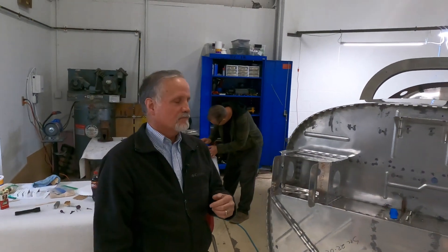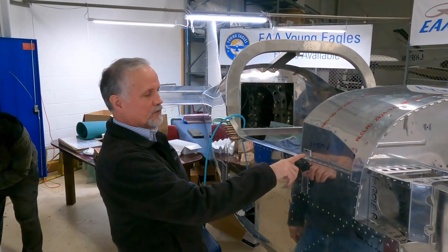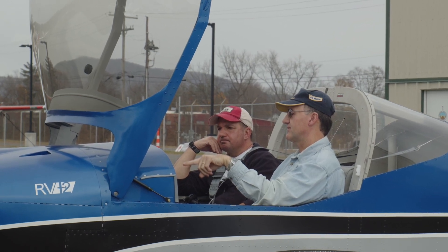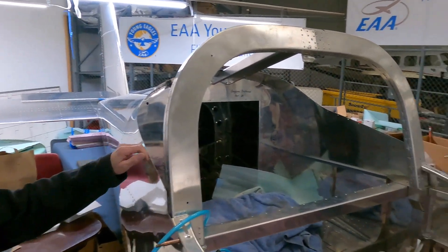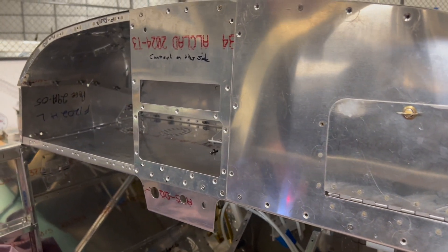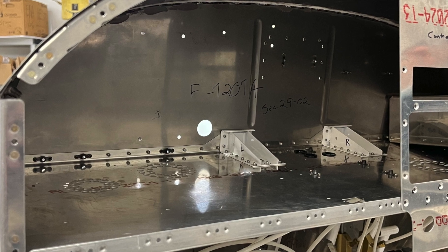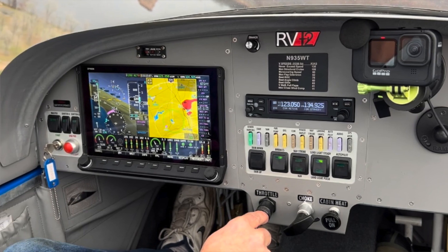If you come around on the sides, you can see that we've added the canopy ribs along with the little L-bracket that goes here for the pneumatic piston that holds the canopy up in position. Looking at the instrument panel, we've started installing the face plates. On the right side, you see the map box, which has been completed, and then the center console for the instrument panel. We have the left side as well — we just haven't installed that yet.